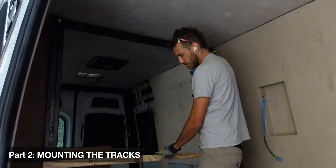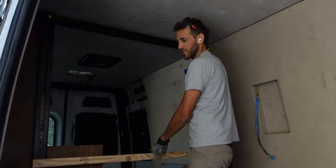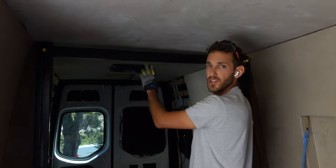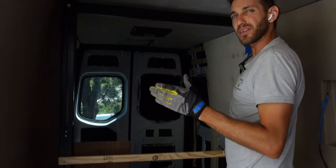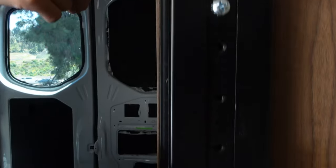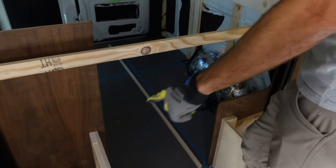When you get your Happy Jack, make sure you do not take these cross beams off. They help you carry it in and out of the van and also when you're putting it up they'll help keep it square. You only remove them after you're done installing the actual tracks on the wall. One thing to note: when I measured the distance between the cross beam ends it was exactly 48 inches, but the bottom of the legs was about an eighth to a quarter inch too small, so the cross beam wasn't holding it at a perfect angle. So we're going to screw in the top beams loosely, take the cross beam off, then make sure the bottom distance is also exactly 48 inches before screwing those in.